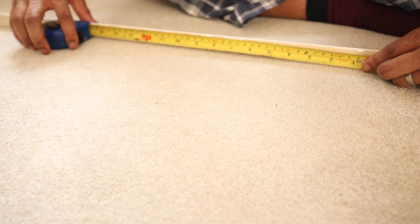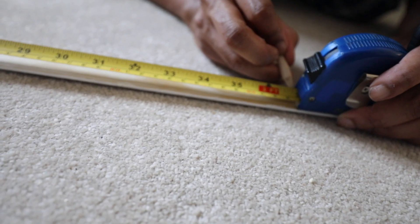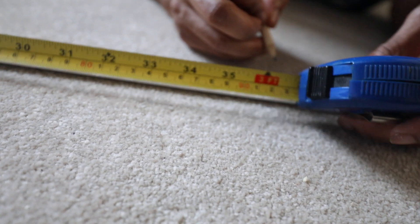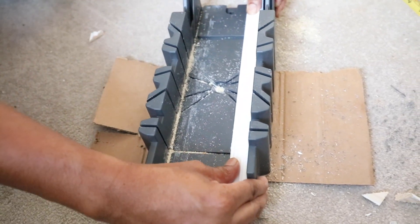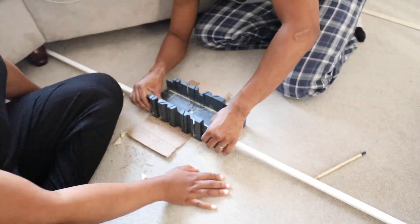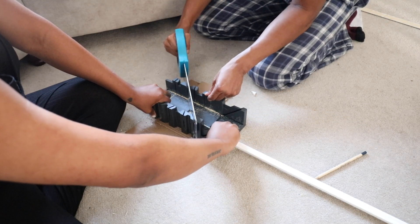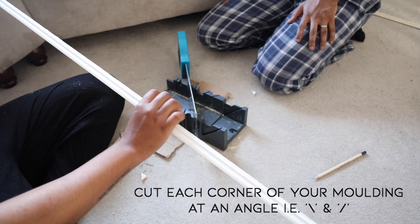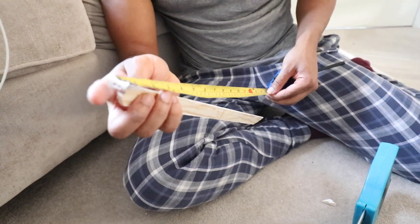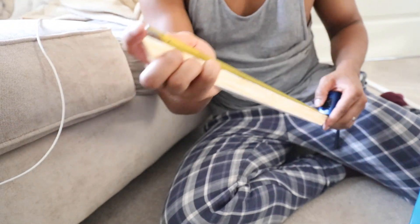Once you have all of these items, you can start. Put your measurements onto the actual molding so you can cut the right length that needs to go on the wall. Make sure you use a pencil, and mark it on the rear side of the molding, not the side that's going to be showing. Now we need to cut it — we're using the saw and the miter box, which we bought from Aldi for literally a fiver. Cut each corner at a backslash angle and also a forward slash angle so it all fits into a box shape. Double-check the measurement once you've cut to make sure it's definitely the right length.